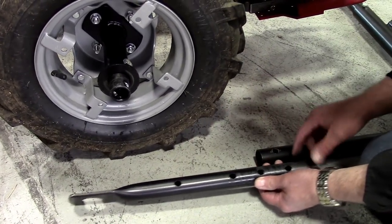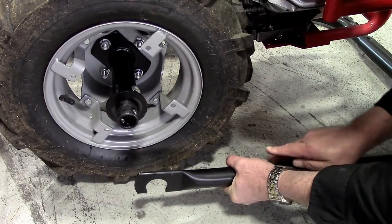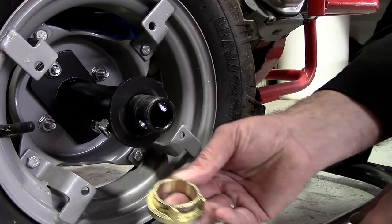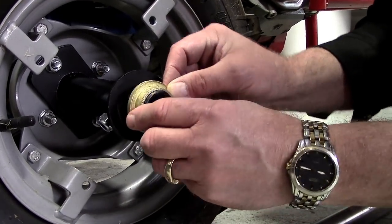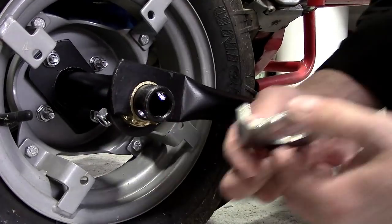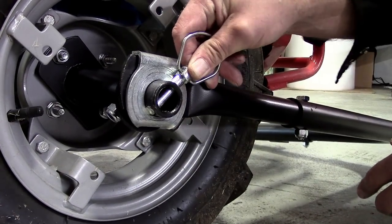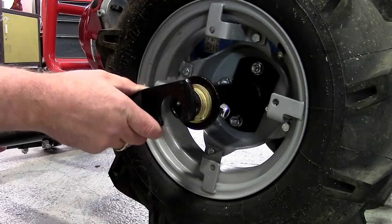Make sure the same hole is used on both sides. To attach each side of the U-frame assembly to the tractor wheel supports, start by sliding the bronze bushing onto the support extension, flange first, with the tabs on bottom. Hook the front arm over the extension tube and slide it onto the bushing. Add the special locking collar with the short tab under the open portion of the front arm and the long tab over the top, and secure with the hitch pin. If necessary, tap the hitch pin with your hammer to get it through the tube completely. Repeat for the other side.